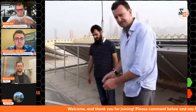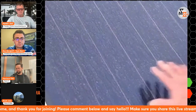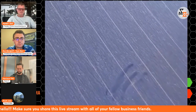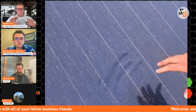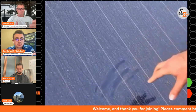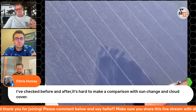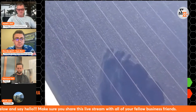All these buildings along the Palm have solar panels on the roof for all the residences. You can see the dirt, and what you're seeing is light coming back to you. When you take that off, you see black, and the black is where the solar energy is meant to go. That's an important point to be able to point out to somebody: if I can see the surface of your panel, I'm seeing your solar energy being reflected back at us, not going through to the wafer or the black surface underneath.